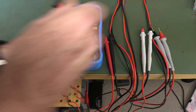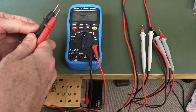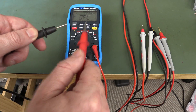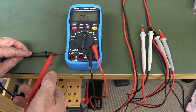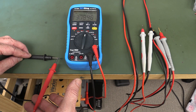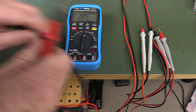Let me compare this with the famous Fluke TL75 probes, which are not gold plated. These ones have been around for decades — they're practically industry standard probes. And look! I'm touching those with a fair bit of force, and sometimes the continuity doesn't go off. I put that down with just the weight of the probe and it's not making contact — unless I get the little ridges in the tip. You can see how poor that is compared to the gold plated Bryman ones.